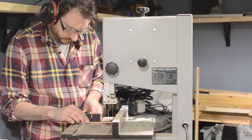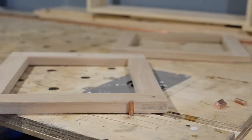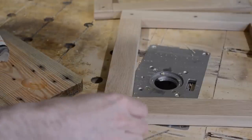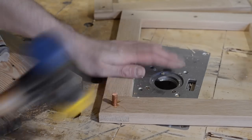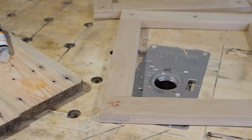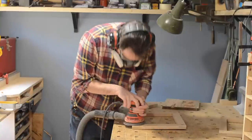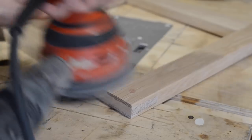I've got some 8mm copper rod that I'm cutting down to about 1mm wider than the legs themselves. I can then mix up a little batch of epoxy, get some spread into one of the 8mm holes, and get the copper bar tapped into place. I get it in so it protrudes a very small amount both sides, and then I come back later and sand it flush — working up the grits to get a nice polished finish on the copper.